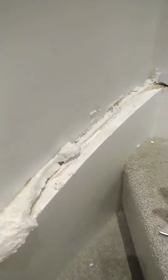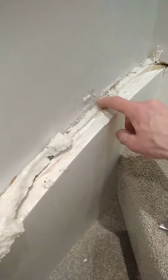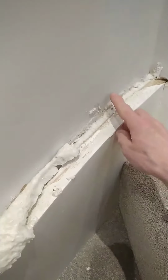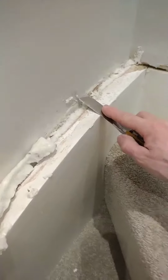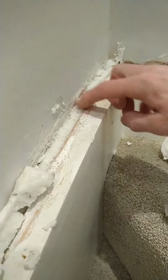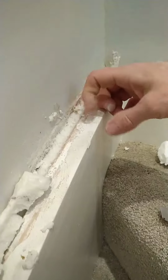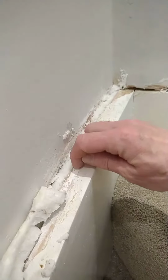Oh yeah, see? And then, because obviously that's not filled flush to the top, that's where I'll then put this fabulous resin filler when I've mixed it up, and I will square it off down the wall across there. And like I said, I'm going to bevel it slightly so it'll be more like that angle rather than like that, because I don't want there to just be resin in here and joining just there, because if it does expand and contract, which it will do, it's a staircase, you're liable to get the tiniest crack there.